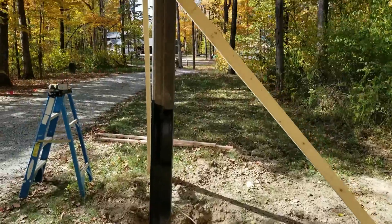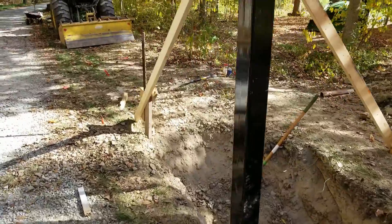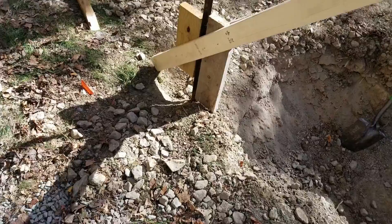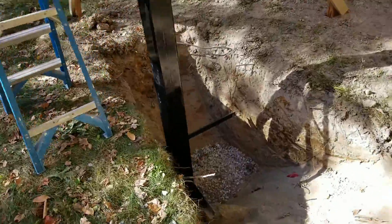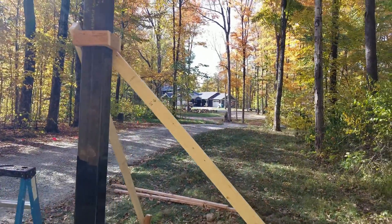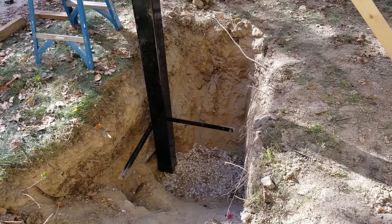I think this one's pretty solid — well, it's got two-by-fours on it, but you know what I mean. So we got everything staked out. We had to get a little creative finding some number two stone with the stakes. Now we're going to build our rebar cages. Once we have those in, we're going to let these things sit for a week because we don't have time this weekend for concrete — but next weekend we will. We put a little collar up top, we're plumbed now on the post. Got our gravel base down there. The gravel down there is really to keep water from standing at the bottom of the hole and letting the post corrode ultimately.